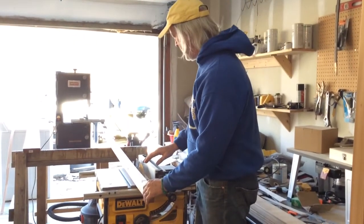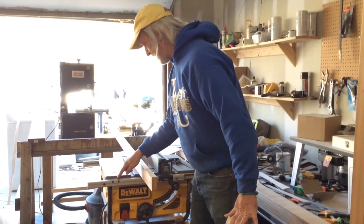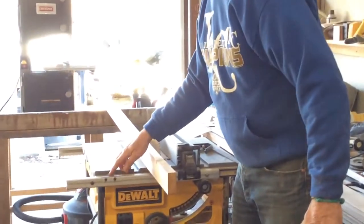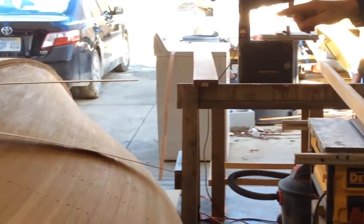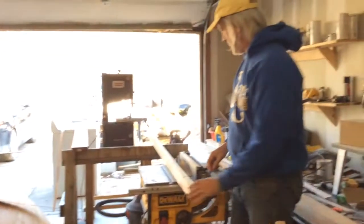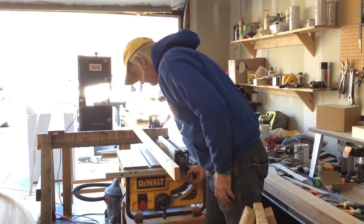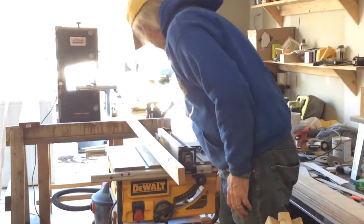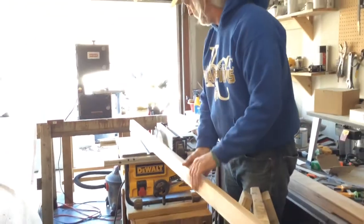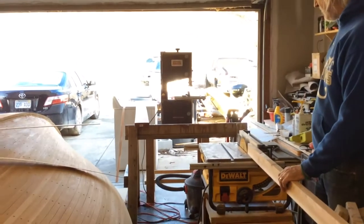There's been a lot of trial and error, but what I figured out is that with the thickness of the blade — the kerf — I can move my fence down three-eighths, and between the thickness of the fence and how much I lose to kerf, it'll give me strips that are just about a sixteenth thick. All I do then is move the fence down — one, two, three-sixteenths — lock that down, and when I run this through, that's going to give me another strip that should be that thick.